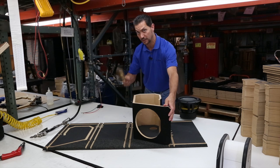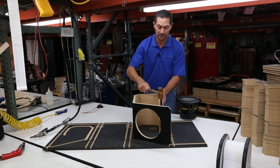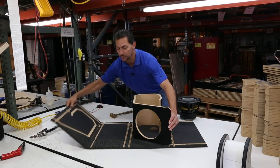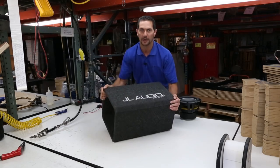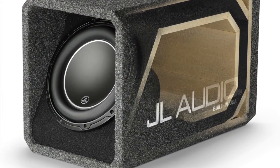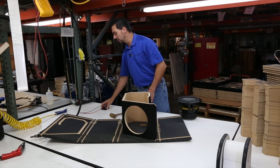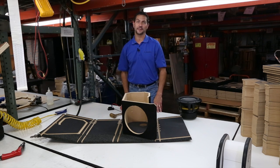And just to make sure they have a little bit of extra reinforcement, they will tap that into place, make sure it fits nice and good. And then they quite simply just wrap the whole thing up, like so, and we have an enclosure. The final steps will be to insert the woofer into the baffle, take our terminal cup and put it in there, and it gets ready for packaging and out into our shipping area.